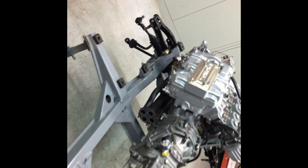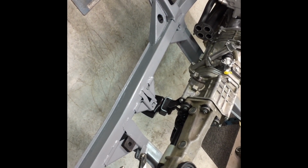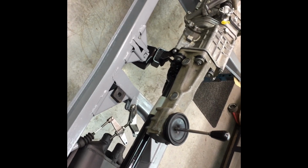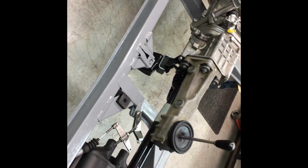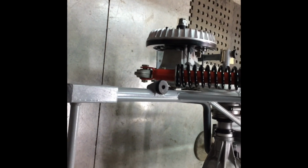I might be back with new spark plugs later. I'll bung them on, but I'm waiting for the mandrel bends, and I'm getting another meter of that 1.25 inches. Is it 32 mil? And then I'll make this section here the last section of the exhaust. Once that's attached, like I said earlier, then I'll see what's going on here. To me, it looks like they don't need bending. It looks like they just come out straight. But they might need kinking up.